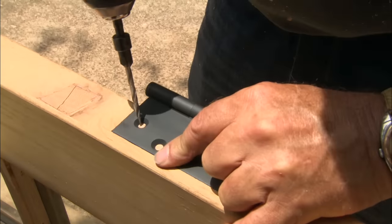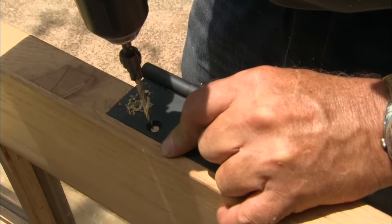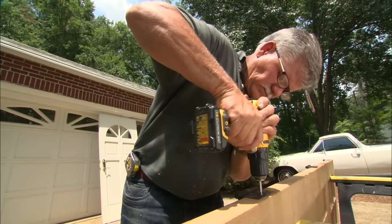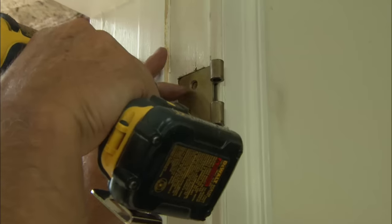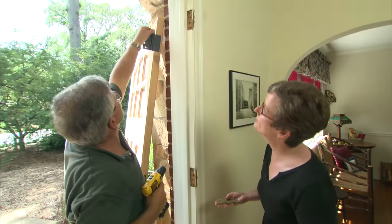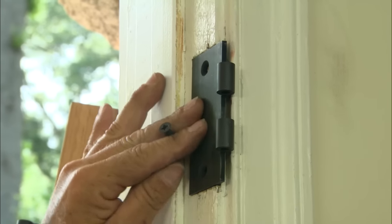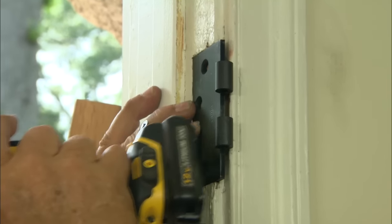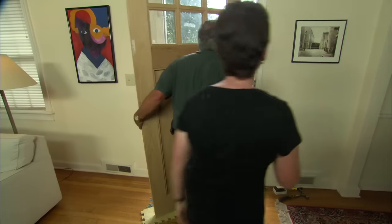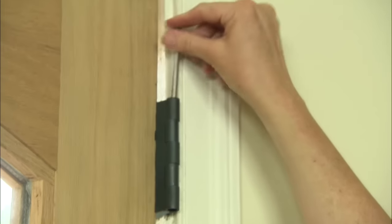It's really important to pre-drill for the screws — they'll hold better and there's less chance of breaking the screw or splitting the wood. Taking all the old hinges off and now I'm ready to replace them with half of the new hinge that was on the door.